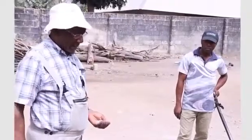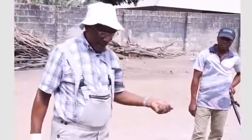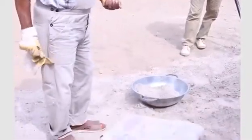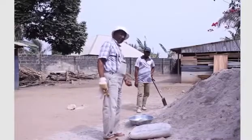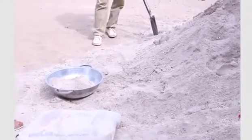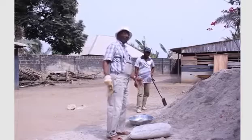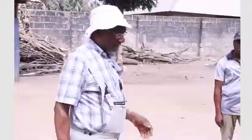The concrete used in molding the interlocking stones is made up of a sharp sand, fine gravel mixture and cement. We use here for our purpose a mixture in a ratio of 13 head pans of the sand gravel mixture and 1 bag of cement. The sand gravel mixture which we use here popularly is what is called abaidaguseme. It's the local name for that. It's not the real name for that. It is a fine gravel sharp sand mixture at a ratio of about 4 of sharp sand and 3 of fine gravel.